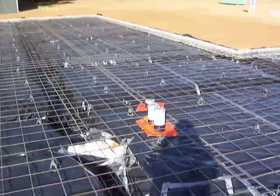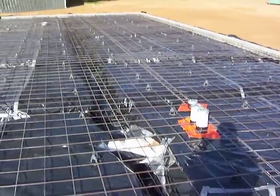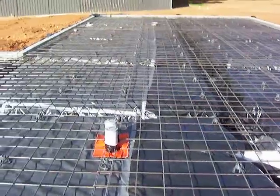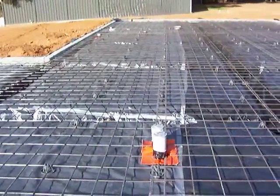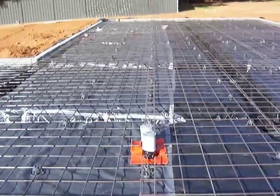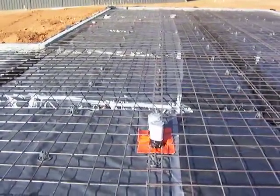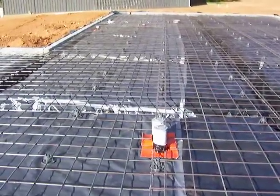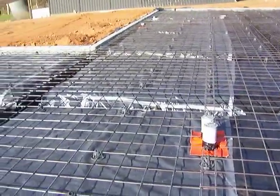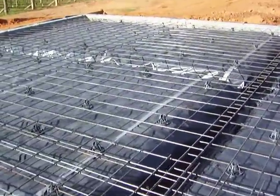You'll also see the orange membrane poking around all the plumbing pipes — this is the cordon white ant treatment. The white ants don't like this at all, so they wrap it around the pipe so you don't get any white ant penetration through the pipework as it comes up into the slab.